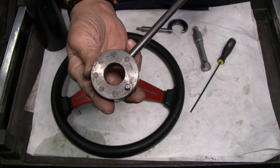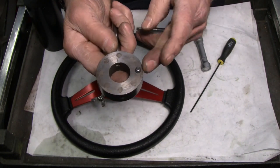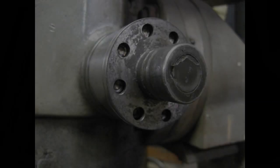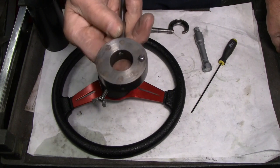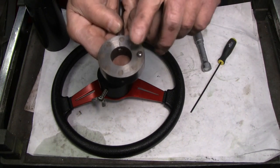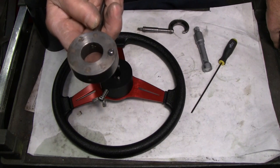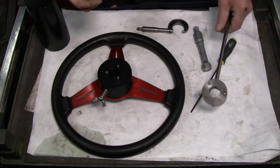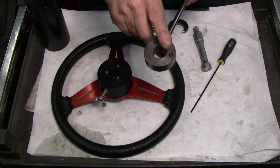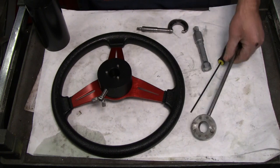We will locate the set screw for the hub we make so that it registers with that groove. It has a single quarter-inch dowel pin to engage one of eight holes on the quill feed shaft input. So we will need to duplicate the hole diameter and the dowel pin — and I think I'm going to put two in. One might be enough, but it's easy enough when we have this in the rotary table: if we're going to drill one hole we can just spin around and drill two. The holes will be bored for a slight interference fit with dowel pins that I'm going to make out of quarter-inch drill rod.